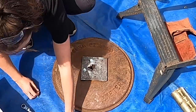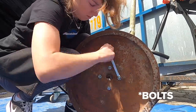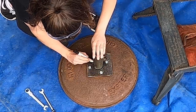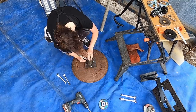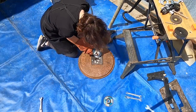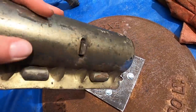All I've done here is put the bolts through the four holes that I've drilled, then flipped it over, popped the washers on, and tightened the screws. Next, I took my scaffolding joint and used it to mark a circle around the center of the base, then marked three points where we were going to clean for the welding. Here I am using an angle grinder to clean the three areas on the base plate including the scaffolding joint. This essentially preps the material for the welding process.